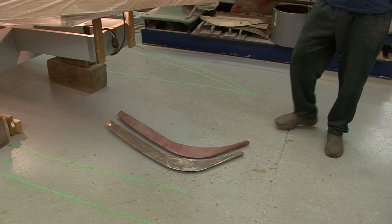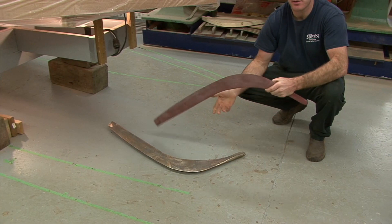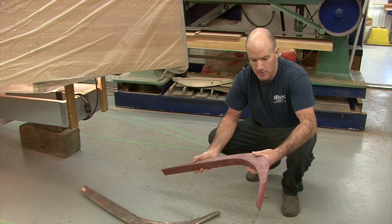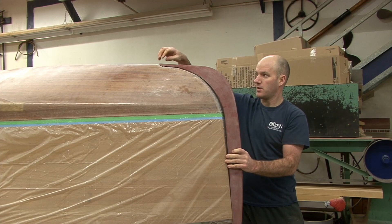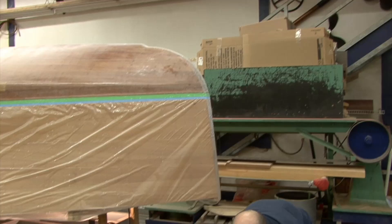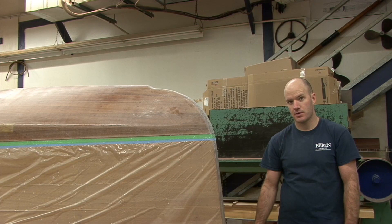This is the wooden pattern we make — each boat's slightly different, so you've got to make a custom cutwater pattern for each boat. We actually add about an inch because they'll shrink a tiny bit. To make the seam tight in the end, I still have to take a bunch off — it'll take me four or five hours to get the metal part fitting perfectly. In the end you get a stunning and durable cutwater. Some of the others are just plate steel; this gives you the ultimate protection.